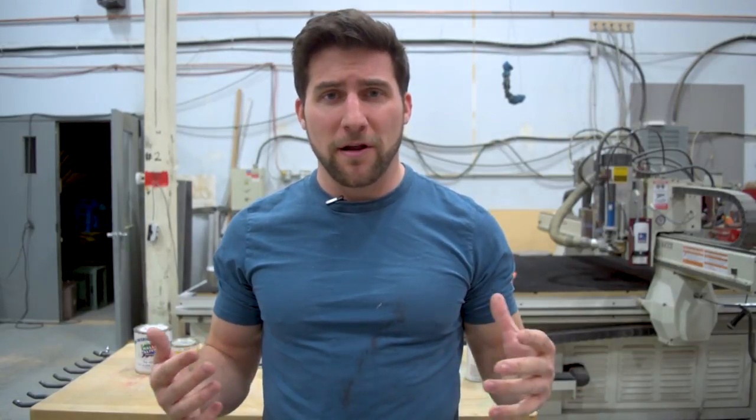So to clarify, even if I'm doing an automotive polyurethane finish on a piece of wood, I'm still using a sealer. Again, it's about the substrate there. I want to seal all of that up so that when I go to paint it, I end up with my sealing coat quickly and I'm able to paint it as though it were something smoother than wood.